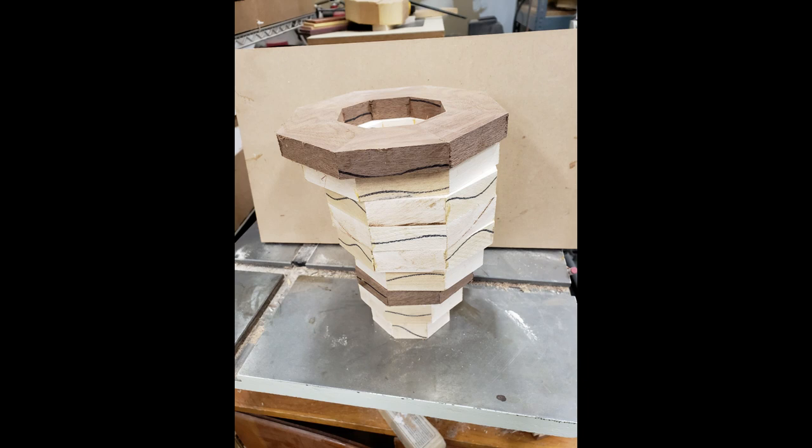For this project, I chose to use segmented wood. This is not a requirement, but it is nice that I can create the general form of the size I want from scratch. If this were solid, I would have rough turned it, let it dry, then re-cut mounting tenons. I created nine segment rings of eight segments each — two are walnut, the rest are maple.